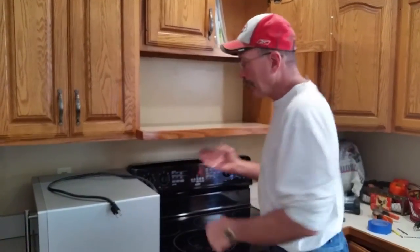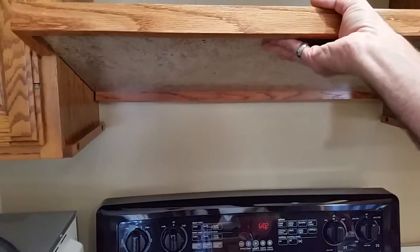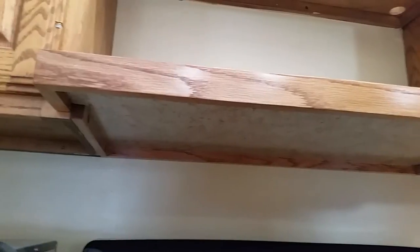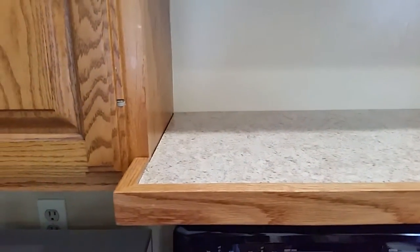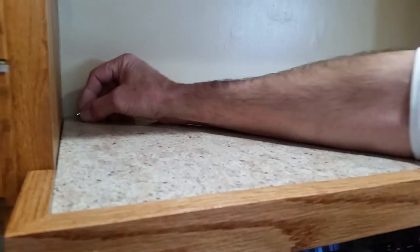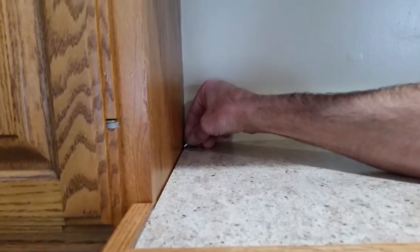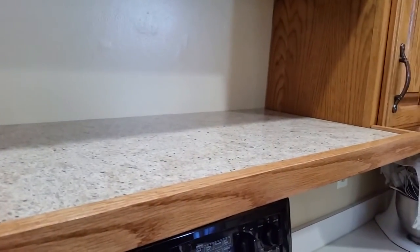I've got a slot on the back side — I left the cleats short from the wall back here so that back end fits in there. That way the shelf can't slide out. I also drilled two holes on top and I've got what are known as shelf clips that you see in furniture. I drilled those in and stuck them in there, so the shelf can't flop out. Works just fine.